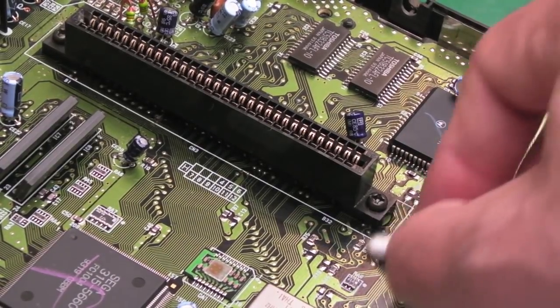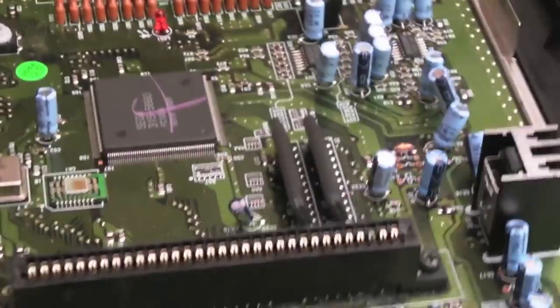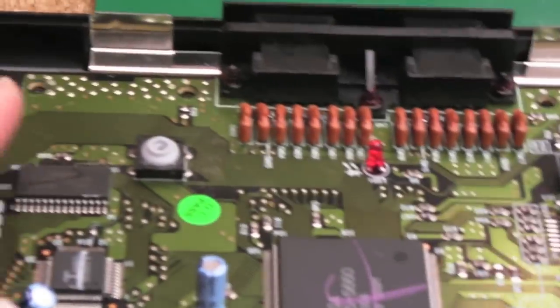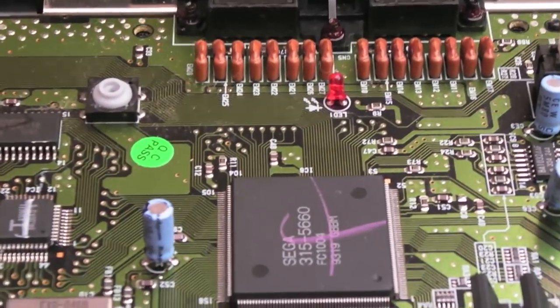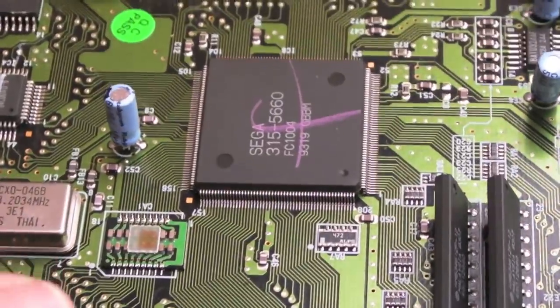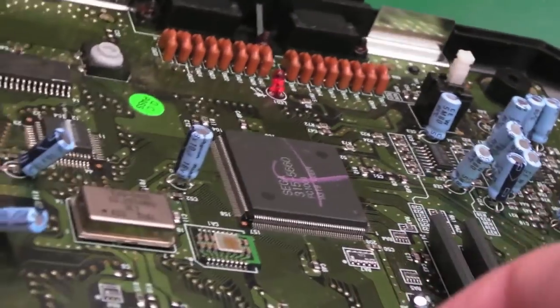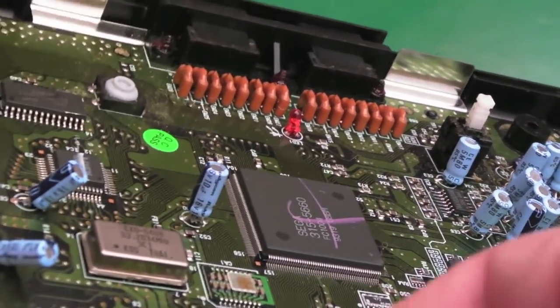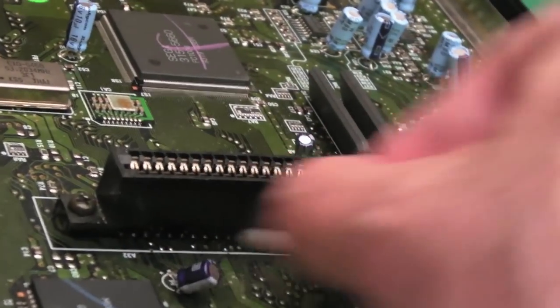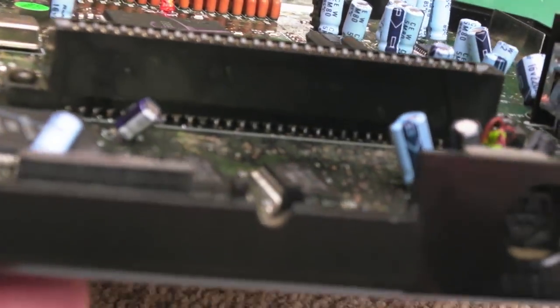The interesting thing with these is I kind of call them a baby Neo Geo, because that's kind of what they are. It's very similar in that you've got a slave architecture with a Z80, primarily used for the sound, just like on the Neo Geo. This has a Yamaha sound chip that has some similarities to some of the sound stuff on the Neo Geo again. They've also got a 68000 CPU, just the same as the Neo Geo. Obviously it's not as fast, but there is a similarity there.